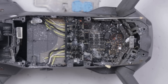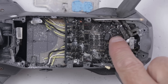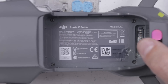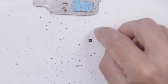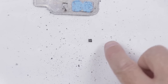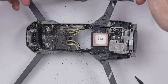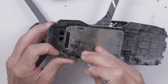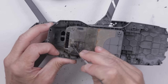Now let's take a look at the board underneath this board. The reason this board is so burned and charred is because of what happened down here — we're going to check this out closer. To get to that, we have to remove the top part of the drone. When I turn that over, look at all this stuff that just fell out — there's even a little chip that just fell right out. Now let's check out the other boards and that burn spot. Oh, wow — this whole case right here is burned up, not quite a hole all the way through it, but pretty close. The plastic is pretty weak right here and just charred away.